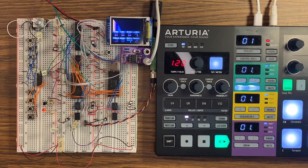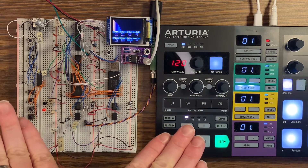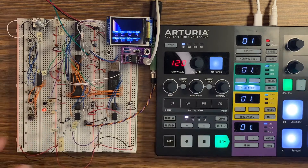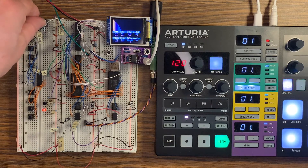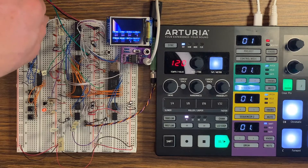One other thing you can do — because there are two chips — is slightly alter the pitch of each one. You can detune one chip higher and the other lower, spreading that detuning across the audio spectrum. You can also do panning, which sends audio to one chip or the other, giving you stereo placement.